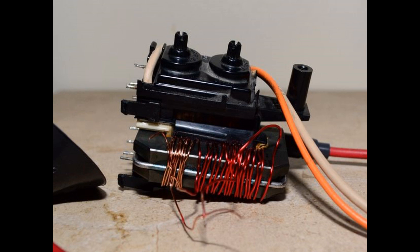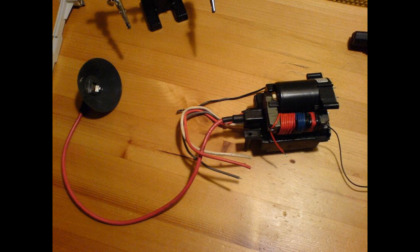Just get a bit of magnet wire and sand off the ends. Changing the amount of turns on the feedback and the primary coil will affect the output voltage. I suggest starting with seven turns on the feedback and 11 turns on the primary, and just mess about with it until you get the best output voltage. But be careful not to over volt it, otherwise it'll break — that's happened to me before, twice.